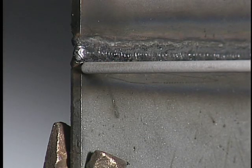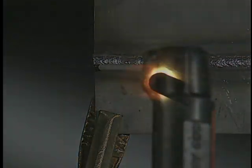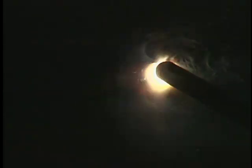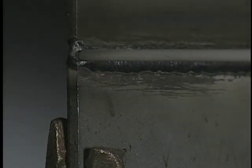For the first weld, center the electrode on the bottom toe of the root pass with a work angle about 0 to 10 degrees above horizontal, with a 5 to 10 degree drag travel angle. Read the puddle and travel at a speed that produces a weld bead about 2 electrode diameters wide. The bottom toe of the weld should overlap the bottom edge of the joint by about 1/16 of an inch. Use a slight W motion to keep the weld bead flat. Then chip the slag to prevent slag inclusions.